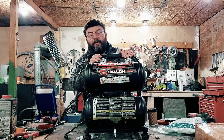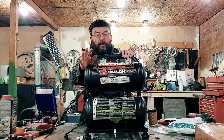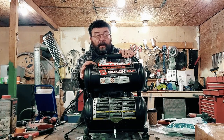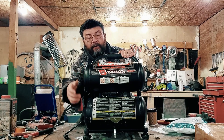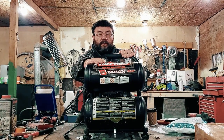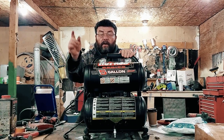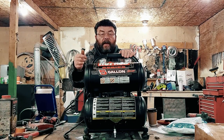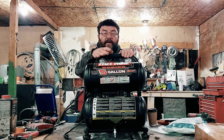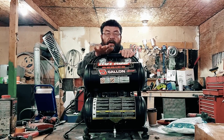It doesn't matter if the compressor is 30 gallons, 10 gallons, or 5 gallons — everything will equalize out. Looking at this compressor, it has two tanks on it, which is essentially what LaMarcRaven wants to accomplish: just two 30-gallon tanks. So we have an access point down here — remove the drain coupler, put in an air coupler, and now you can hook two compressors up side by side and run them off one regulator. This is the easy method — it'll get you out of a jam, but I'm also going to give you the right permanent method.